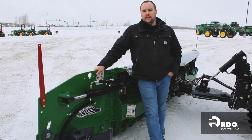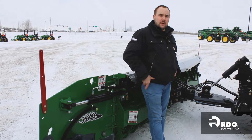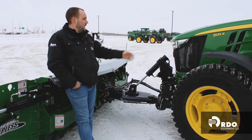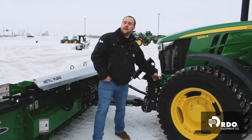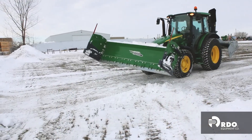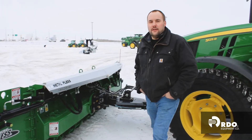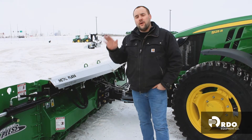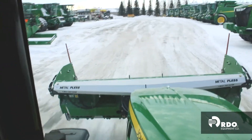Standing next to this MetalPlus 1016 plow, how we achieve the mount on this is the exclusive MetalPlus subframe mount. This is exclusive to MetalPlus and it is designed for this 5125R to go right up front. It attaches to the rear draw bar and expands underneath the entire tractor and then mounts up front on the front of the frame. You have a single cylinder for lifting the blade, your angling cylinders, and your other cylinders for wing deflection as well. One thing that is unique here is this does have a nitrogen shock on it, so when you are traveling down the road going from job site to job site, you get a cushion or suspension out of this front blade to take a lot of the shock out of the tractor and off the operator.